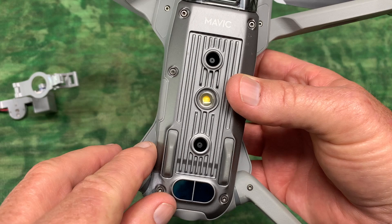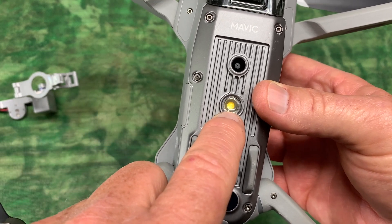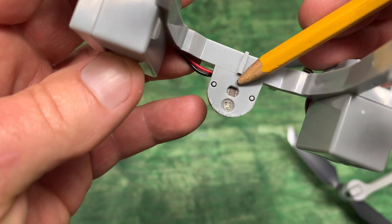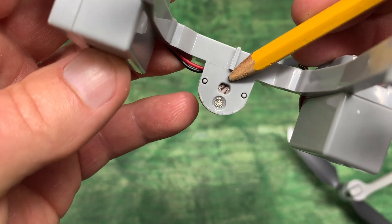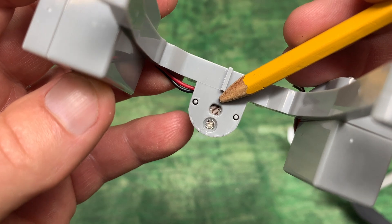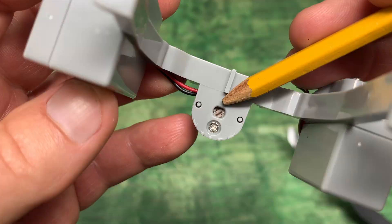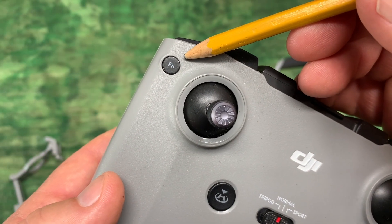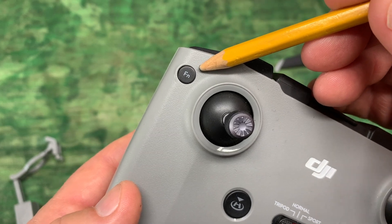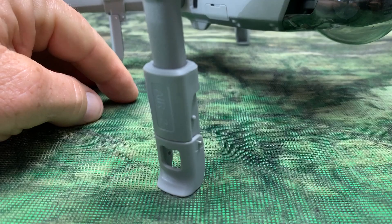The concept of how this works is quite simple. On the underside of your drone, there is an auxiliary LED light. On the payload release system, there is an LED light sensor. When you trigger the light on the underside of your drone, it will trigger this sensor and in turn make the payload release system work. On my remote controller, I will use the function button to turn that light on the underside of my drone, which will therefore trigger the payload release system.